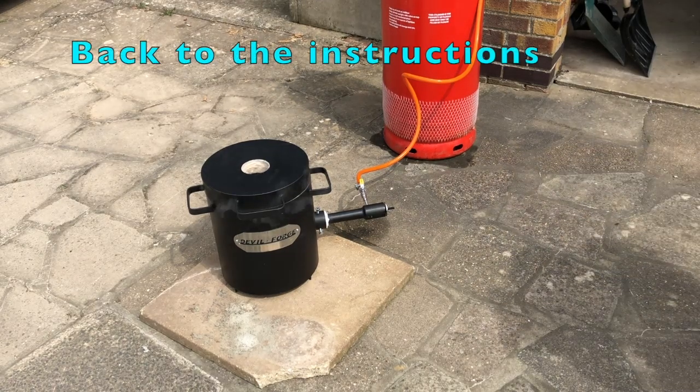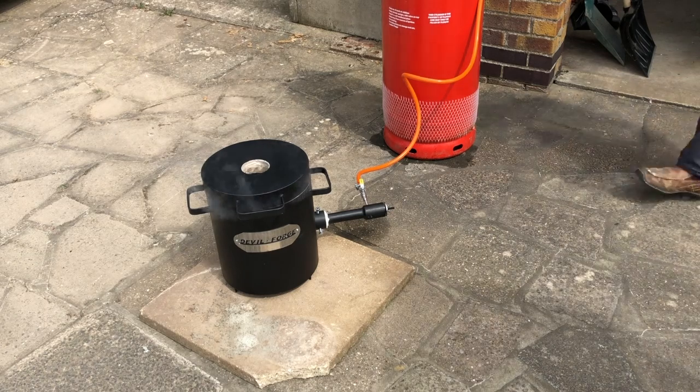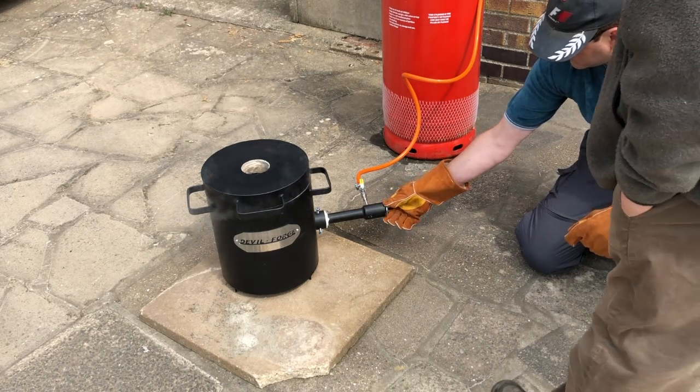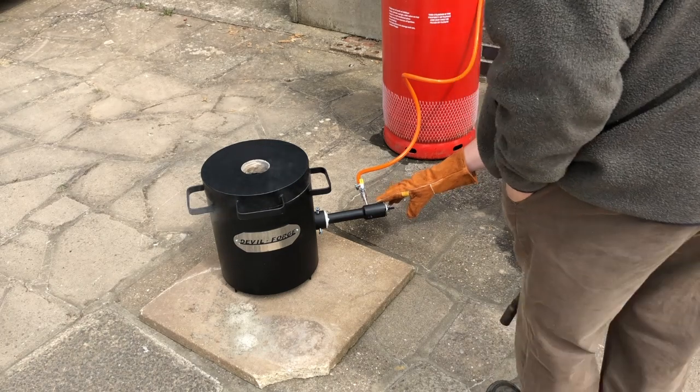How to adjust your air choke for the ideal flame. Open the air choke about 8mm. The correct flame should be a bit blue. A dark blue flame is correct, while the other is incorrect, which is too much air. A bit more. See, as soon as I touch that, it changes it. Wow.